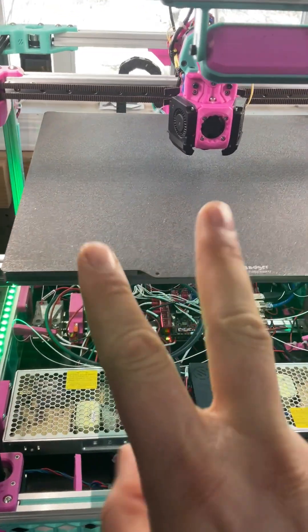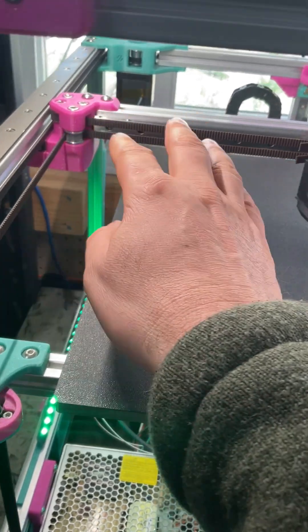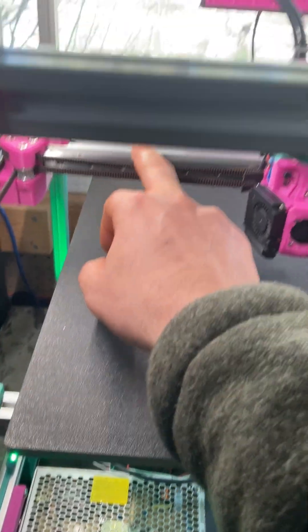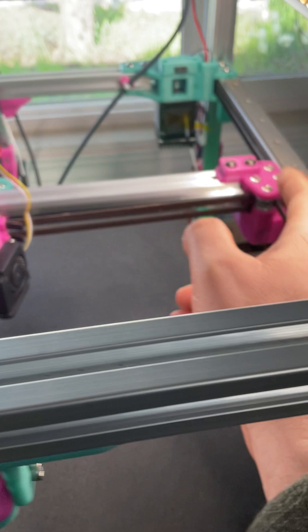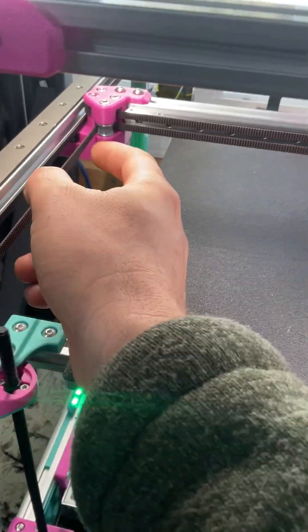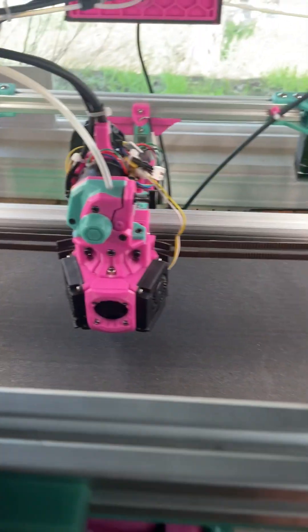There are two kinds of racking. Mechanical racking is when you set-screwed everything in and your X extrusion wasn't perpendicular to your Y extrusions. The other kind is belt-induced, where you tighten one belt way too tight so that the belts themselves are throwing it off kilter — you're getting an angle.